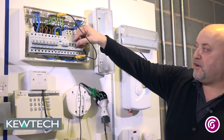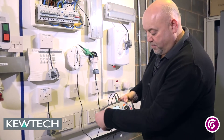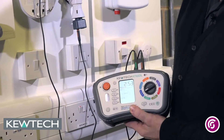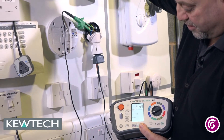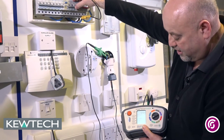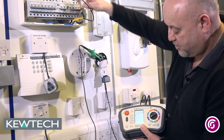We don't know which circuit it's on, so there are only three circuits that size, so I'll turn all the breakers on. Push and twist so it's in constant testing mode and you can see I've got a circuit. I simply turn off using the functional switch on the RCBOs one at a time — there you go, it's broken the circuit, so that point is on circuit number three.